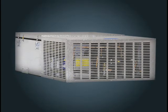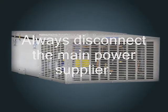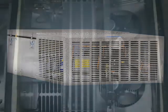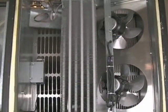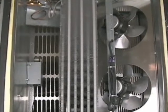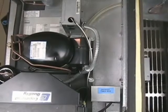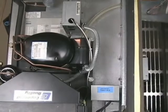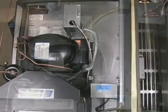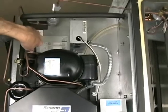When servicing any refrigeration system or performing any maintenance procedures, always disconnect the main power supply. The condensing unit, condensate vaporizer, and the control box on low temperature models are all accessible by removing the grills or louvers on the condensing unit housing. The evaporator coil section is accessible by unlatching and removing the evaporator section housing cover. The efficiency of the condensing unit, to a great extent, depends upon the movement of air freely through the condenser. For this reason, the condensing unit should be as clean as possible at all times and should always have an unrestricted supply of air.